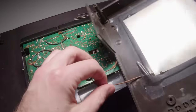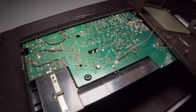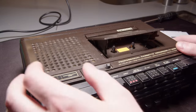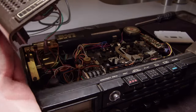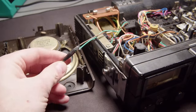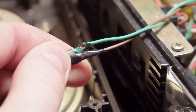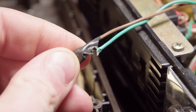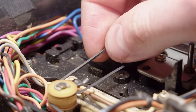And that little, I guess it would be some kind of EM shield. Yeah, that wire tripped me up. So I'm just gonna desolder that, get that out of the way. Now that those screws are removed from the bottom, we can just pull this up from the top, and you can see that speaker has had some problems with it, and it seems whoever had this apart last just blasted right through that wire with one of the screws. Now, I think that still technically would have been a connection, but that's pretty funny. It's no surprise that that happened.